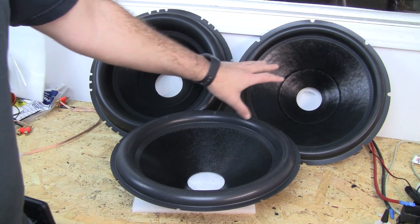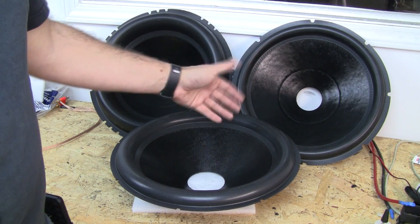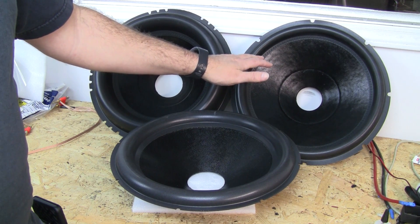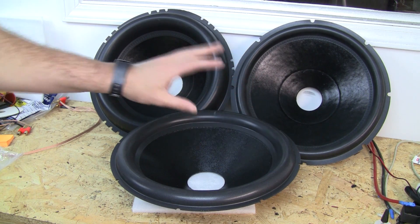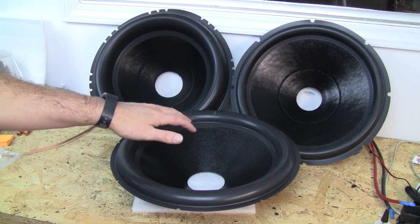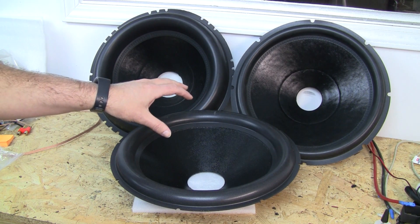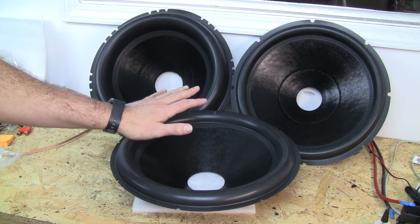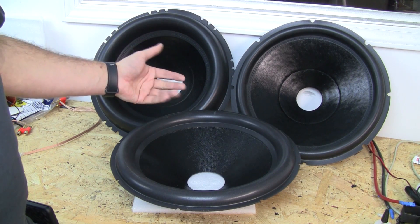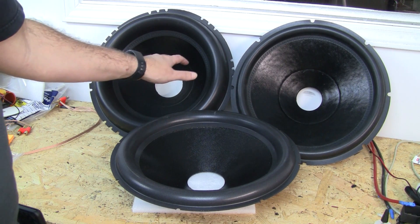This one will fill in a little bit of difference between these two — there's actually about 19% difference. So what does that mean in actual output capability? Well, between these two, since this one is around 19% larger, you're looking in the neighborhood of around 0.5 to 0.6 dB louder, assuming everything else was exactly the same. That's just sheer displacement under theoretical conditions. On this one compared to here, we're talking double — double the displacement is going to be 3 dB theoretical gain. So that is the equivalent of keeping the same power and having two of these to get the displacement of one of these. You can't always just look at it as having less cone area, so it doesn't work out. The actual displacement is significantly more, so you can get more output even on the same power.